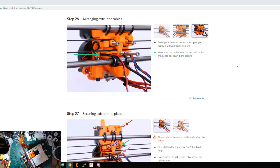Now I will print PETG on 75C. Really? Because I use 70C for my PETG on my printer. Like I've never had any problems with it. Okay. This stuff. Okay. This is supposed to go through here. There we go. Okay. Cool. Yeah, ABS is starting to give me headaches. I was like, all right, that's enough. I'm not printing this stuff anymore.